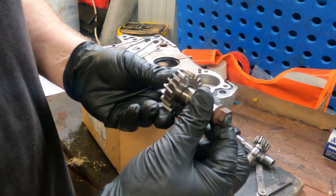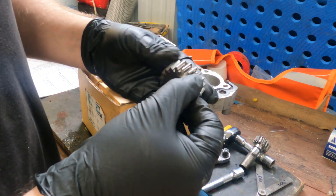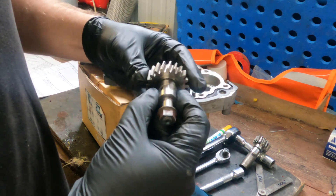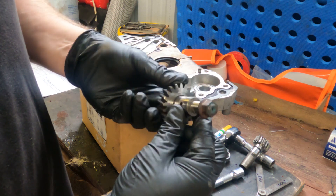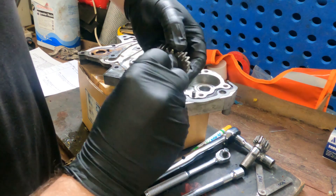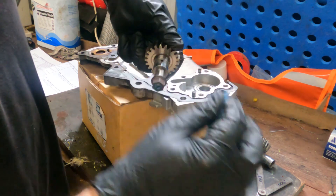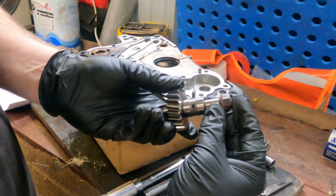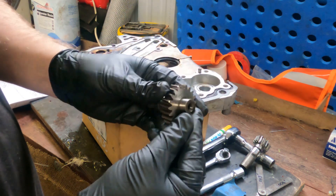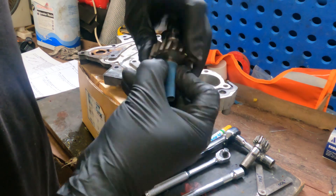Same with the driven gear — just looking for any gouge marks, signs of excessive wear, corrosion, or pitting. This one looks fine. Checking the bearing surfaces, making sure there are no gouges or pit marks — just a light polish, not taking any material off, just for inspection. You can see that one looks nice and flat on both sides — no gouges, no corrosion.